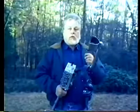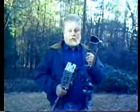That wraps up the SLB adjustment — it will become second nature once you do it a few times. Here's a little tip: on a cold day, repeat the procedure every 15 minutes for the first hour or so when you first get out into the field. Remember, the two things that affect the coil balance are temperature and power. This gives the unit a chance to get used to the temperature and conditions.